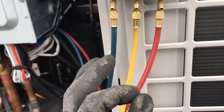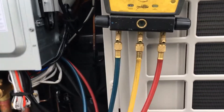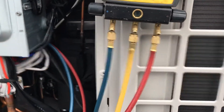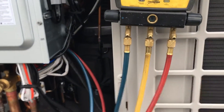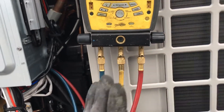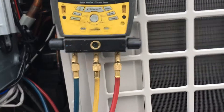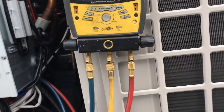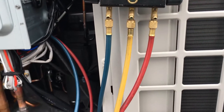I'm focusing on my brazing at all my spots, and yes, I did find a leak — on the backside of one branch where I was hanging over the side of a box off the side of the roof downstairs. I had a leak and had to go down and fix it. I found the leak at 23 psi; I noticed as I was going up that it was taking a little longer.